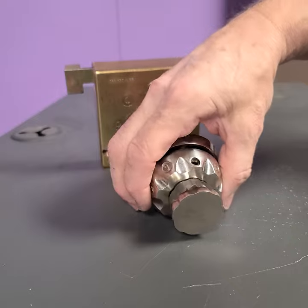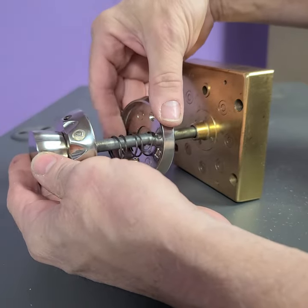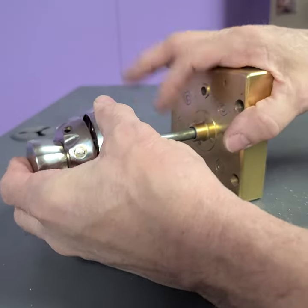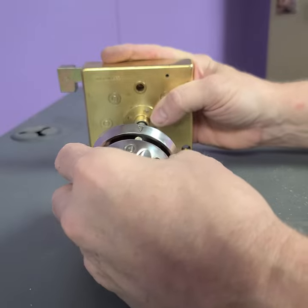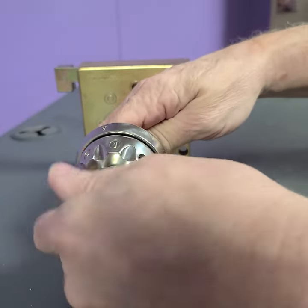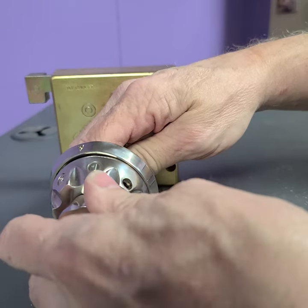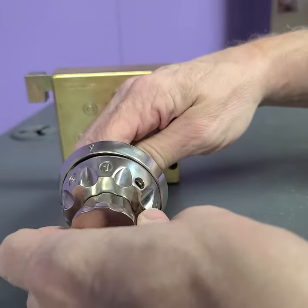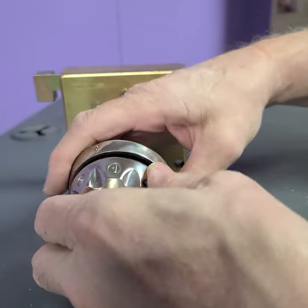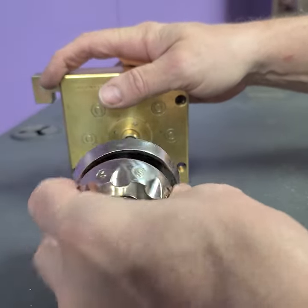So you have 7 positions. First of all, the plate, the dial ring, has a spring that holds this out from the lock. So you push this in to change to one of your 7 positions. And once you're in a position, say number 1, then you dial by the number of clicks. There's 13 positions, so 0 through 12 clicks. Then you push it back in, go to the next one, it'll lock in place, and you do the same thing through all 7.